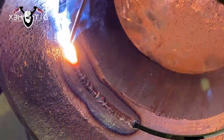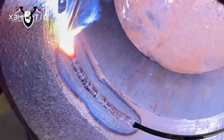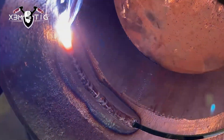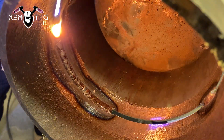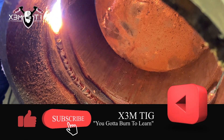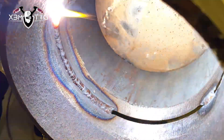We're going to progress up all the way to the tack. Before you reach the tack, pull it out and finish the tie-in from the outside — try to go as close as you can. At that point, pull it out, pause on the tie-in, add wire, remelt and go over that tack. Pass that tack and that's where we stop.